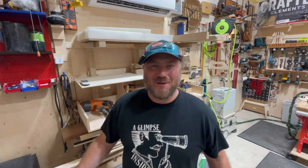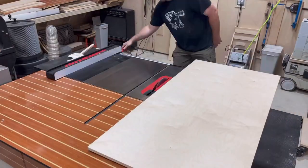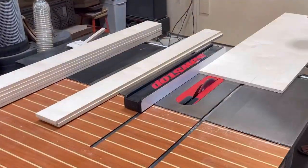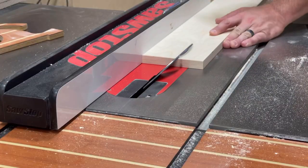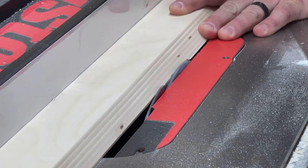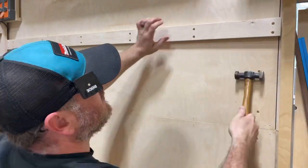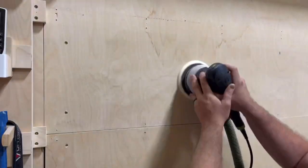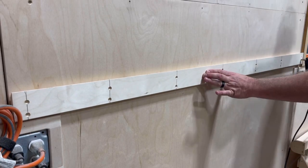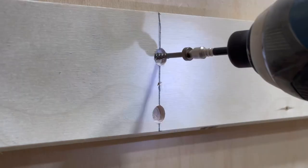You don't really need to see me take everything off — it's all done. Well, you can see a little bit of water damage there. That's because the condensate line got clogged one time, but that's neither here nor there. Let's go ahead and put some fresh French cleats up on the wall. I'm doing these the traditional way with the flat bottom and the 45-degree bevel at the top. I'm cutting these around five inches or so, then bisecting those right in half, giving me two evenly spaced cleats. Make sure it's level, tack it in place with some brads in between those two countersunk holes, and then take a panhead screw and install it just like this.